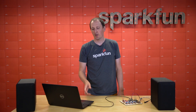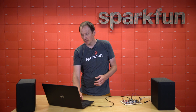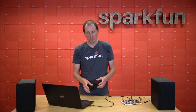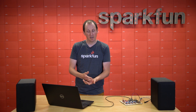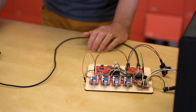For example two in the Arduino library, we're going to play with volume. It's as simple as calling a single function — track gain — where you can set different volume levels. In this example, we start at negative 20 dB, then negative 10 dB, and then zero, progressively getting louder each time it plays the file.